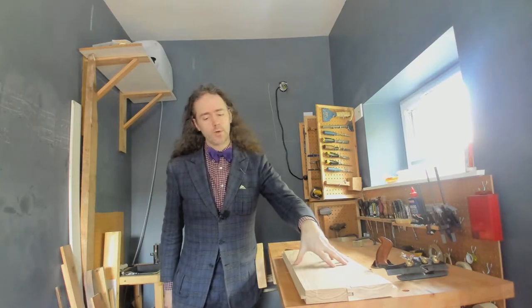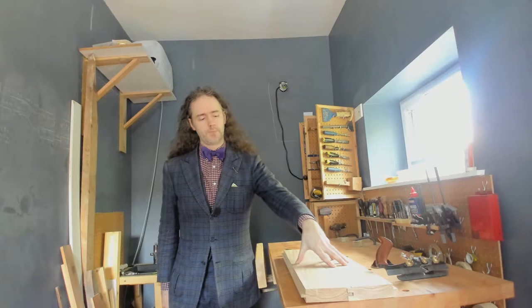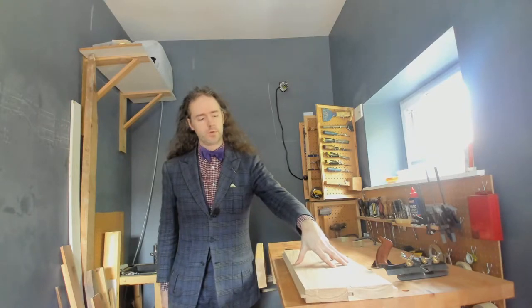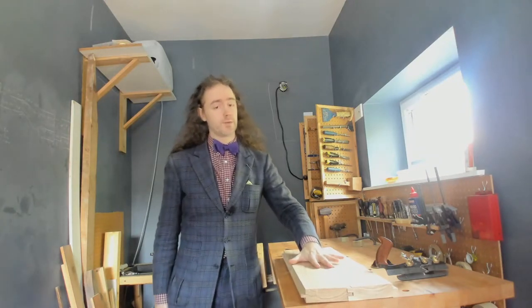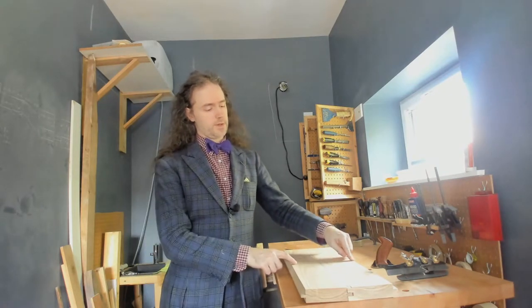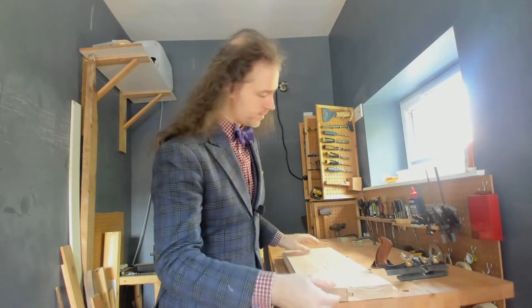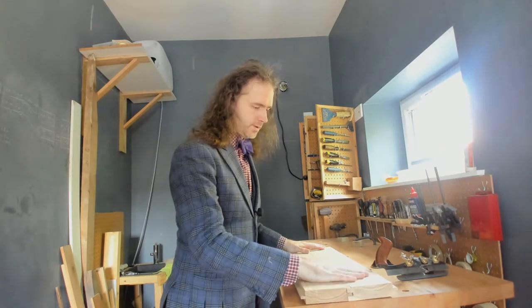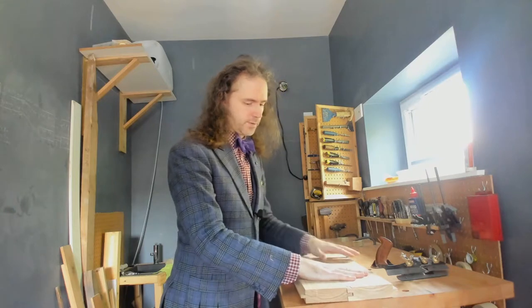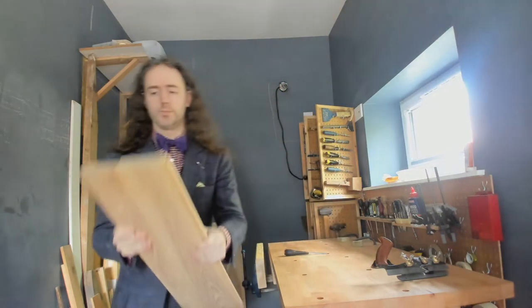This week I'm looking at one of the issues I've had with the tongue-and-groove joinery. This is two of the pieces from the middle wall, back of the drawer section from my desk pedestal. As you can see, it's a bit wobbly. So this needs to be flushed — the drawers need to be able to hit the back of this solidly, and that's not going to happen with this angle.